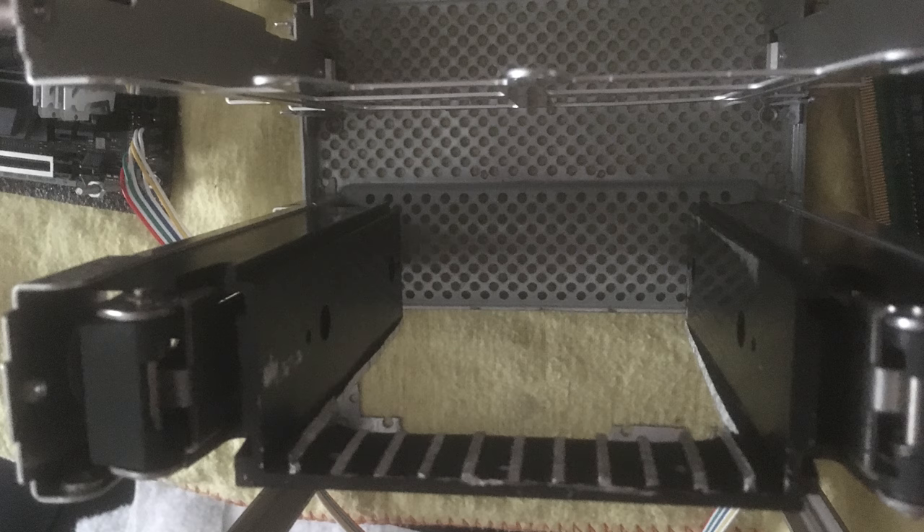The GPU plugs into the motherboard with a PCIe slot. Usually I would use a riser cable to connect the two, but I needed it just long enough — and it also takes up a lot of room. I needed a right angle to connect the end so it would do a U-turn underneath the GPU. I bought six different components trying to connect them as snugly as possible. 25 centimeters of cable bending back onto itself — although usually not recommended — actually worked out pretty great.